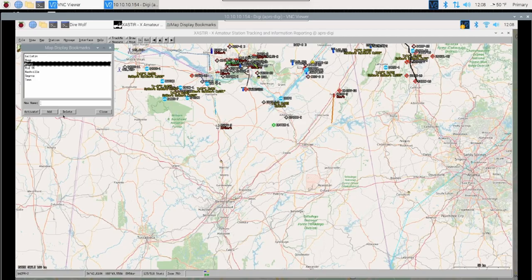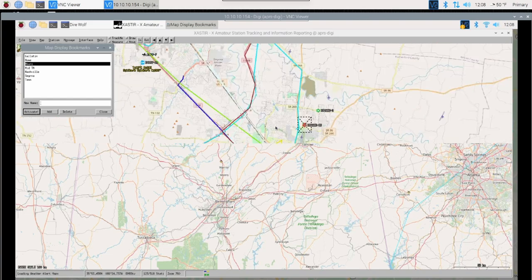One of those things is going to be an APRS DigiPeater. This will allow anyone at the Winter Field Day site walking around with an APRS-capable HT to easily get into my DigiPeater. No internet connected, but if I can get an antenna up at about 30 feet for the APRS Digi, it should be able to DigiPete their signal to the wide area Digi in our area, making it super easy for them to get that APRS signal from their HT into the wide area Digi that they probably wouldn't be able to get into otherwise.